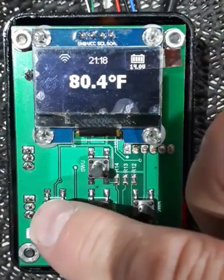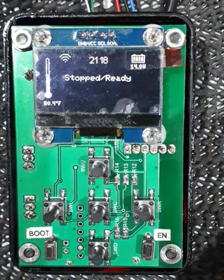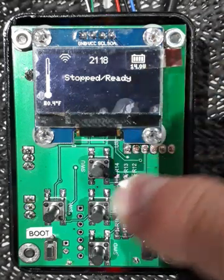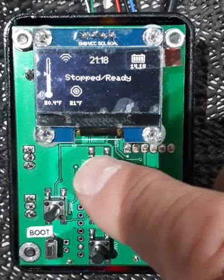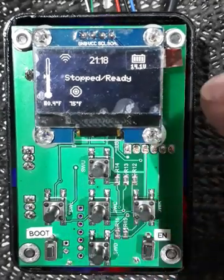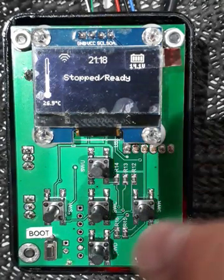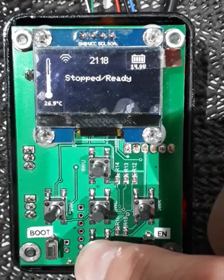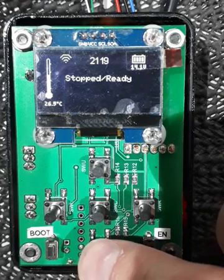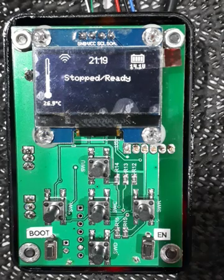People have possibly seen this detailed screen, which is just to the left of the main one in the menus. It's the detailed menu screen — same sort of deal, I can set the temperature up and down by pressing the button. We're in Fahrenheit mode at the moment, so up and down changes the target temperature. If we hold up again, we toggle back to Celsius, and down allows us to toggle from fixed mode in Hertz back to thermostat mode in degrees Celsius or Fahrenheit depending on how you've set it.